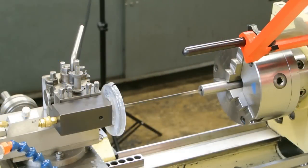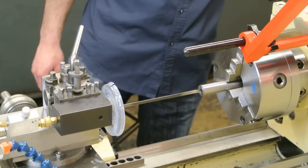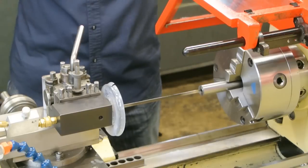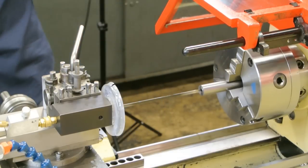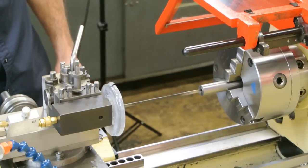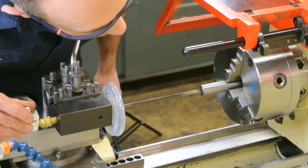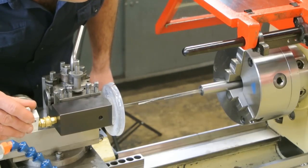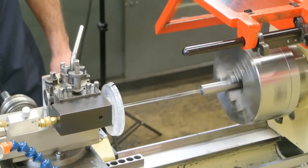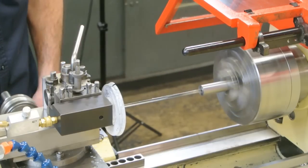Once the coolant has primed the pump and the flow ensues in the pipework, it will start to register on the sight gauges. The coolant pressure should pulse between 150 psi to 200 psi. The air supply pressure should be between 80 psi to 125 psi. Before drilling commences, there should be visible droplets of coolant exiting the start hole on the Ventec tip. Start the lathe spindle in motion and engage the feed.